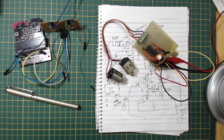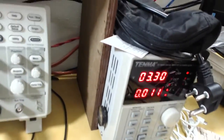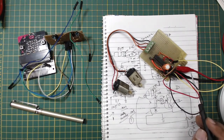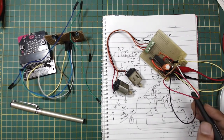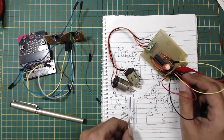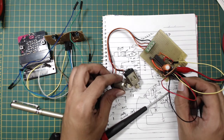I've connected two DC motors and set the bench power supply to 3.3 volts — you can see it's drawing about 0.1 amps. Both VCC and V-motor are supplied at 3.3 volts. I've grounded the speed pin and left the direction pin floating with a pull-up. Pulling the speed pin out — there we go, the motor starts spinning. Grounding it again stops it.